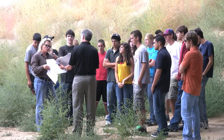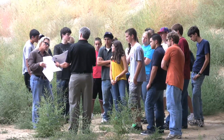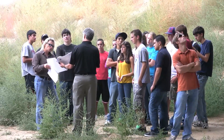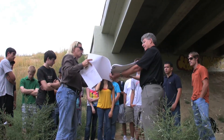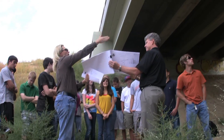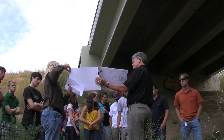So then you get to your next page. All these drawings are labeled, so you kind of know what you're looking at. These are drawings of the girders and what they look like — these big pieces right here — and they give you the dimensions normally. This is a cross-section of the deck. If we were to slice this whole deck in half right here and look at the end, this is what you're looking at — a section view of the superstructure.